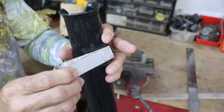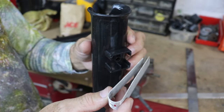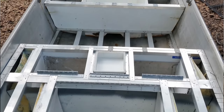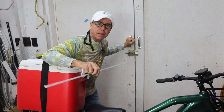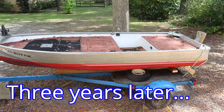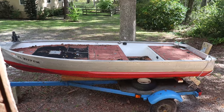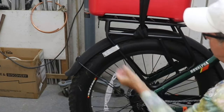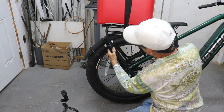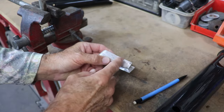That makes for a nice round bend. Now I can see how much I need to cut off to drill a hole and mount it through the mounting hole on the rod holder. I'll measure what I cut off, subtract that from the original size, and that tells me how long to cut the next three. This aluminum is actually scrap left over from when I did my rowboat-to-bass-boat conversion, where I cut all the aluminum seats out of that boat and kept it just in case. I mark my spot, realign the center mark with the hole, mark for length, and cut both legs at the same length.